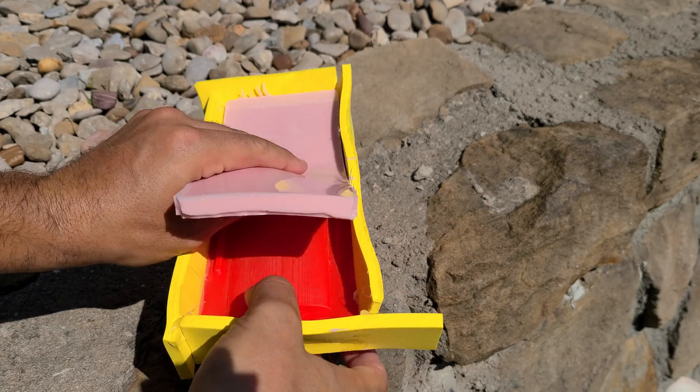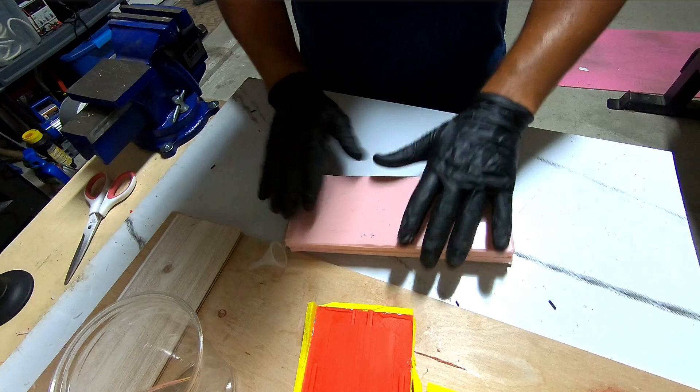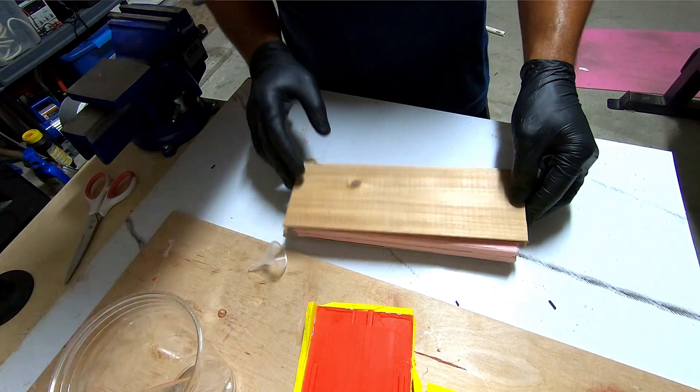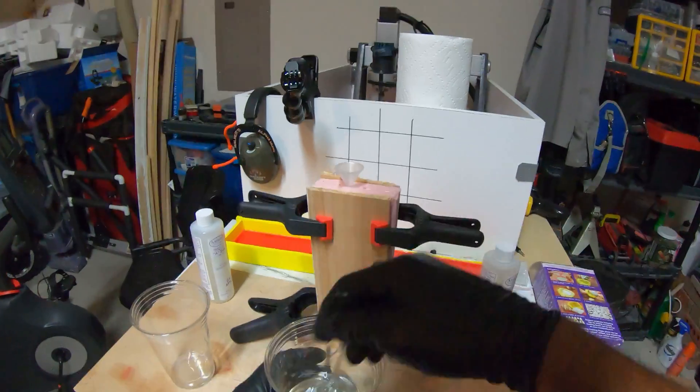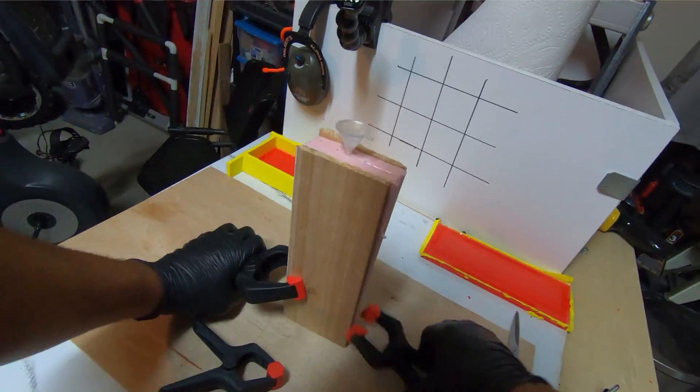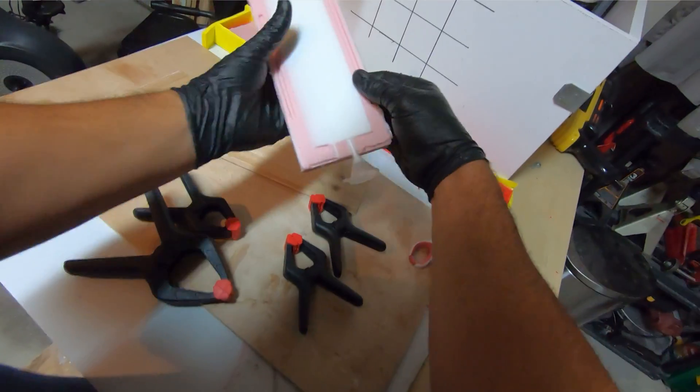When they're done they should peel right off. With some combinations you may need a mold release, but check what the manufacturer recommends. Now we need a backing board to hold the back sides of each mold half flat during the pouring process — just use any flat material that extends the full width of the mold and cut it to shape. Then we pour the resin. This resin cures super fast so you have to work quickly, but that means demolding in about an hour. A little cleanup and the part's ready to use — I can make a ton more of these, saving time versus 3D printing everything while getting to control the material properties.